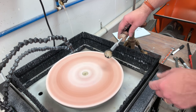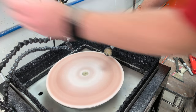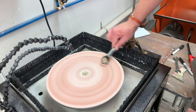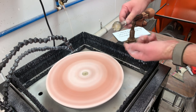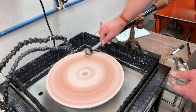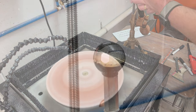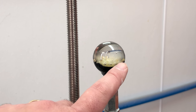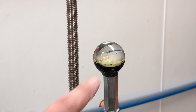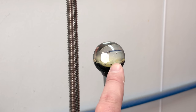Again I'm going to take a little bit of cerium, squirt it onto my pad, and then make several swipes. Every so often you can pick it up and see if you've got some cerium on there — it's a little milky white still, so I'm still good and don't need to add any more. I'm going to make a couple more swipes here to get this first facet polished. Now the fun part — you may be able to see the slightly hazy pre-polished facets, and then my first little facet that I've polished. And if I move out of the way, you can see it's reflecting the light quite nicely — it's acting almost like a mirror for our studio lights and reflecting the light from that clear polished facet.